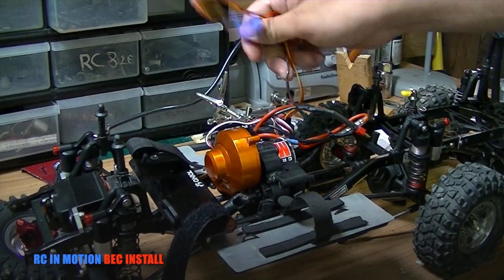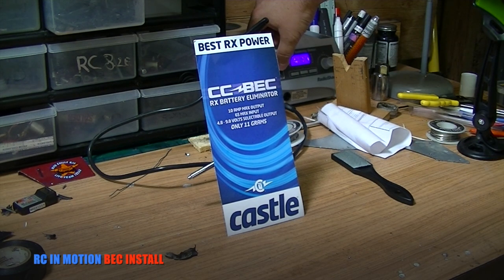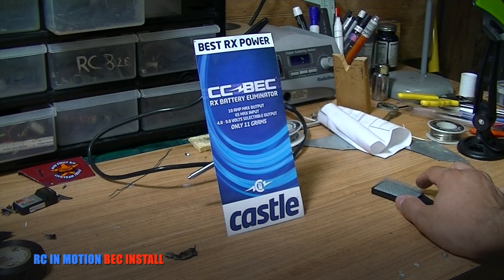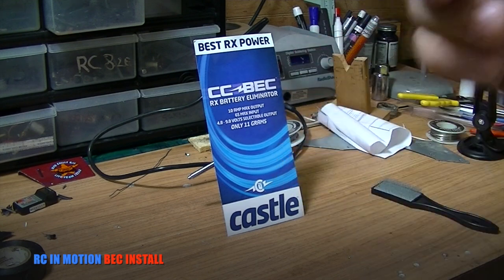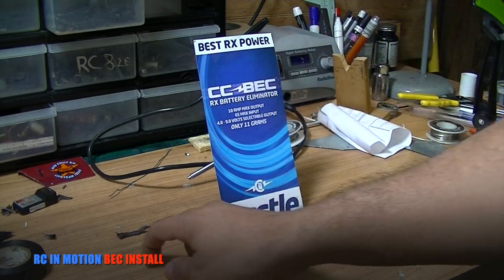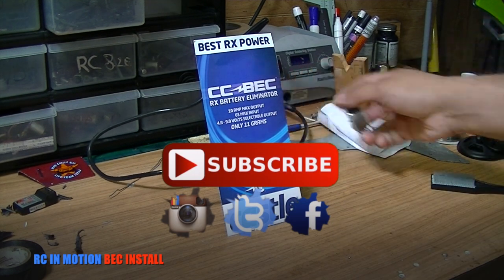It's all a matter of rerouting the cables and wire and you should be good. Hope you guys learned something today about BEC and how to connect it, and about soldering. A tech tip: make sure when you set your heat, you don't overheat the wires too much — because the heat shrink will conform to a hot wire. Keep your soldering quick and precise so you have enough time to put on the heat shrink. Stay tuned for more tech tips and thank you for liking and sharing.